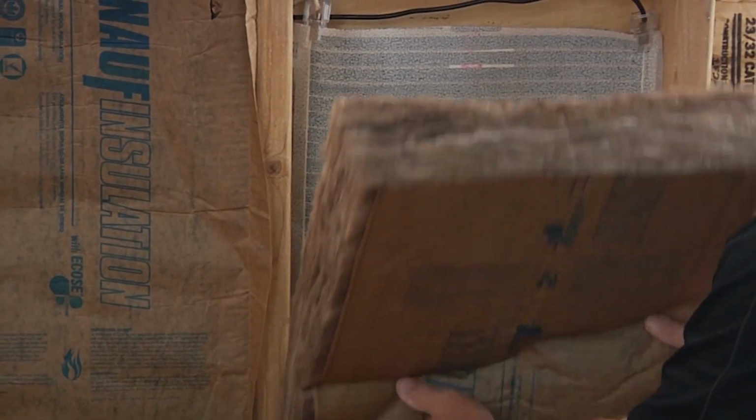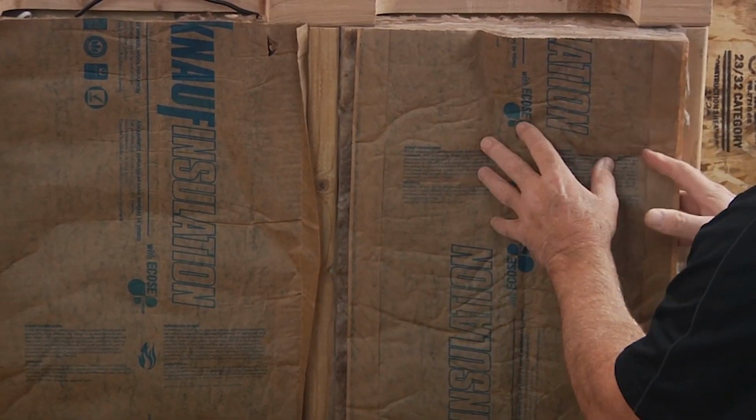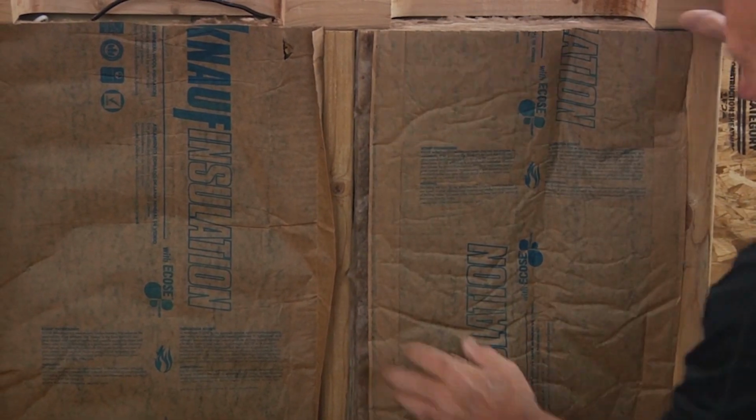Ensuring that we are pushing the heat upwards, install thermal insulation beneath the joist mat. When first turning on in-floor heat, it may take up to 72 hours for full results on the surface of the floor covering.